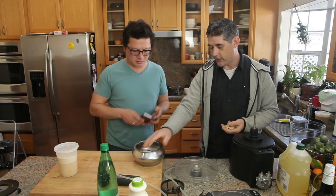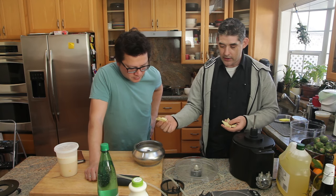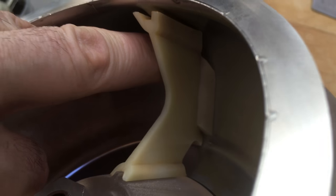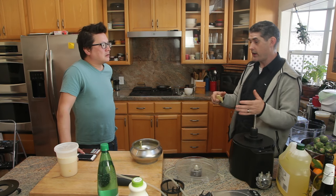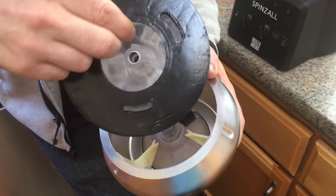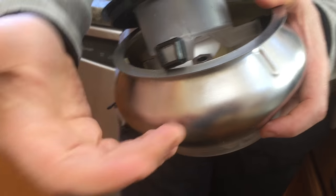This rotor — unlike using vials — you just load it continuously, so you're not balancing anything. These fins come out and it seems like you might lose them, but see that wedge behind the fin? It's allowing liquid to slip past around the very outside. So it balances itself just like a washing machine — it uses the liquid or paste to self-balance. To add stuff continuously, you feed the liquid underneath the surface into this zone. You go like this, and when you feed product in here, it's feeding underneath — it comes out of the little tubes underneath.